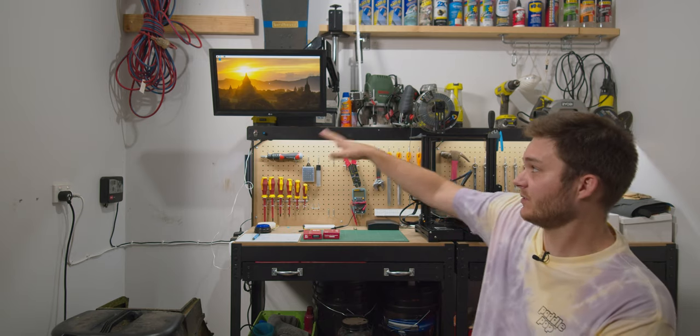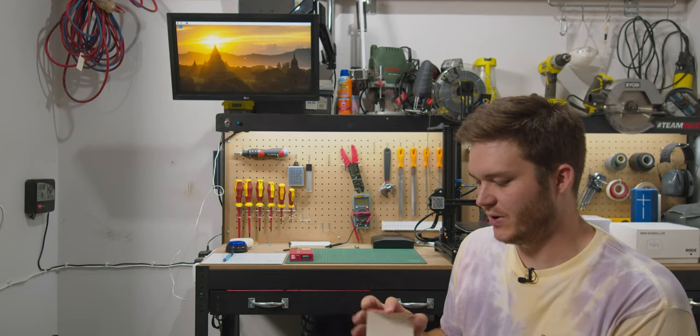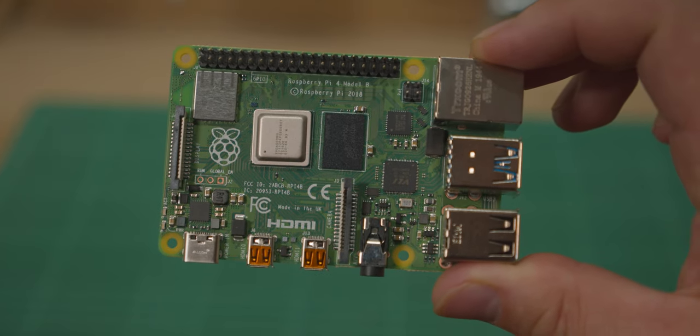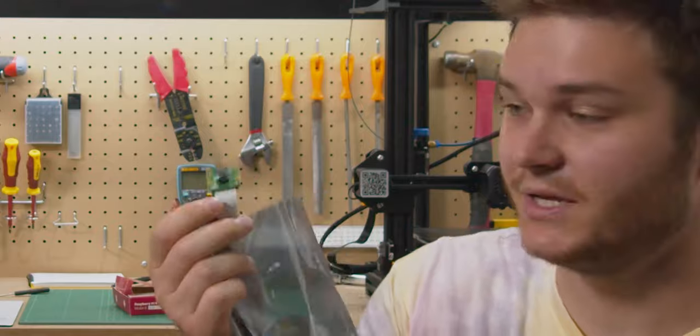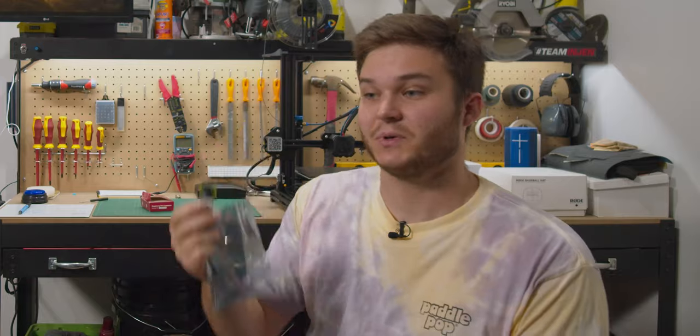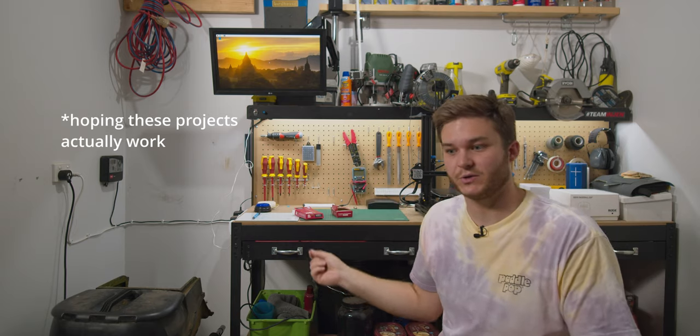So what's next for me and my 3D printer? I've taken the bikes down in the garage and I'm going to build an enclosure — soundproof, to not only dampen the printer noise but also keep it dust-free from the garage mess. I've also picked up a Raspberry Pi 4 which will run an OctoPi print server — a really cool way to send prints from my desk in the studio down to the 3D printer. It'll also detect errors through a Raspberry Pi camera that I can mount in the enclosure, as well as create those cool time-lapse videos. Future models I want to design include a mini retro PC case for the Raspberry Pi, custom LED lighting for the studio, and a MIDI keyboard for my PC.